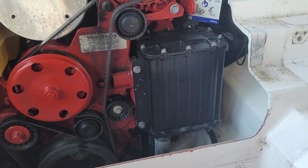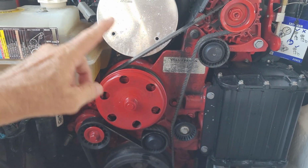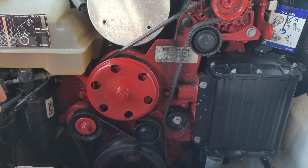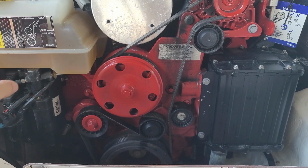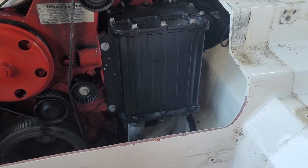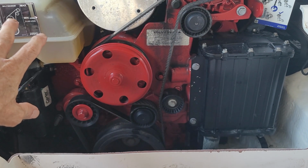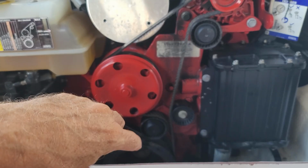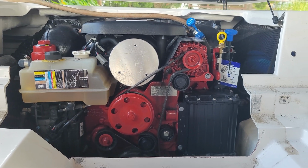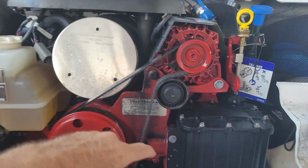It's not that difficult. A lot of people don't like to work on Volvos. This is a magnificent engine. It's got an aluminum core, it's got a heat exchanger, it's got a closed loop cooling system. It's really a dynamite motor. Now, having parts being so difficult to source is one deterrent for people not wanting to work on them. And the other is, and this may be the case with others as well, it's really a hodgepodge of parts, some of which were sourced locally, some of which were sourced overseas, and so it's a mixture of metric and SAE.